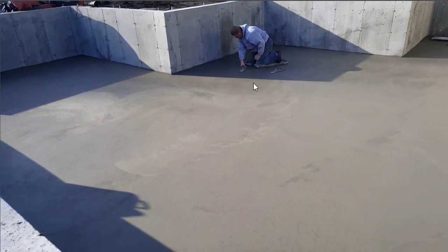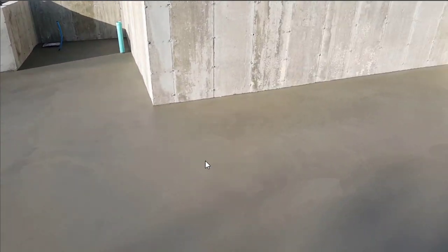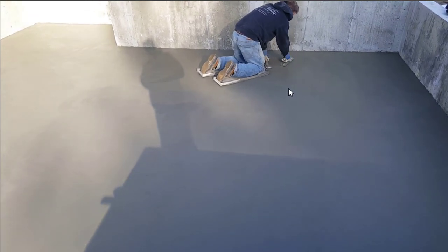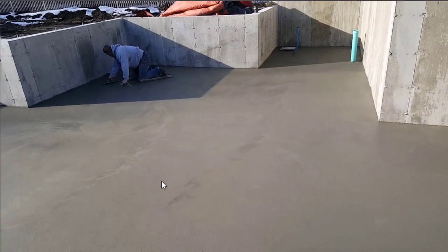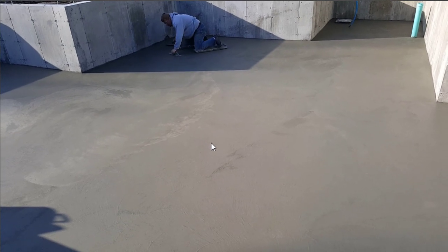These concrete skids make finishing concrete pretty easy by hand. All you do is just kneel down in them — they've got knee pads so it doesn't hurt your knees. You just have a hand trowel in one hand and a mag float in the other. You use one hand to push off with and to balance yourself, and the other hand to wipe the concrete smooth.